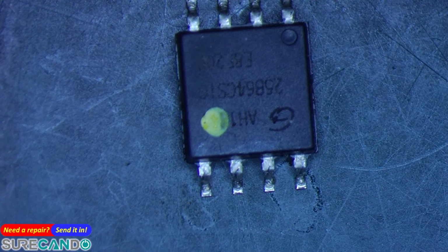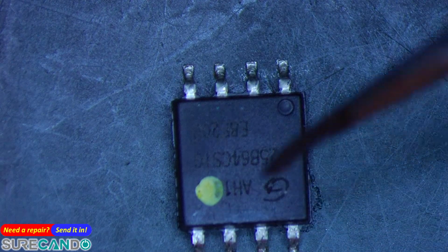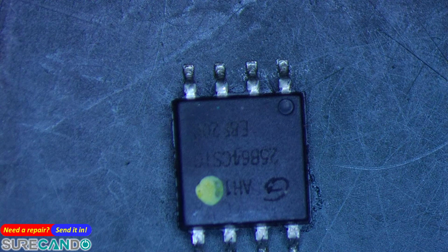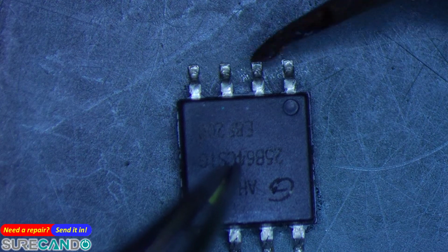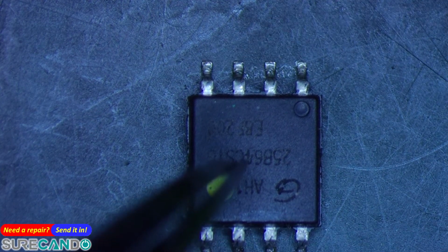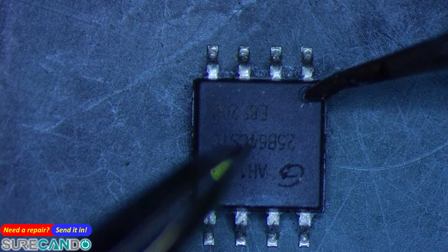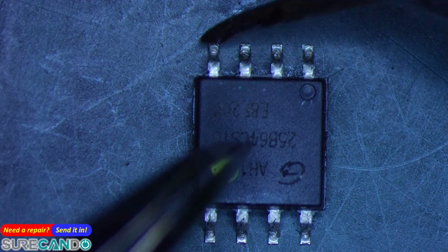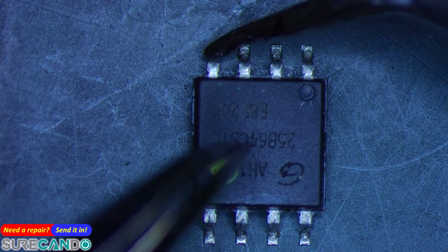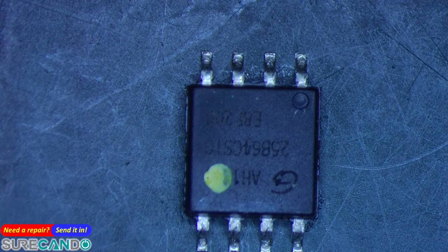So this is a typical BIOS chip. Yeah, okay. So what you need to know is the orientation is very important. You can kill the chip. Okay. So pin number 1, 2, 3, 4, 5, 6, 7, 8. But the only thing you need to remember is if the dot is here, that's pin number 1. Number 4 is always ground. So from your connector, the black pin is going to come to here. So I'll keep that orientation same on the microscope. I'll switch the camera.